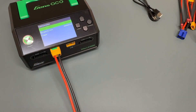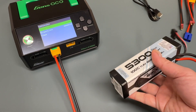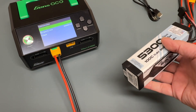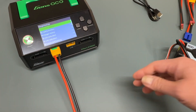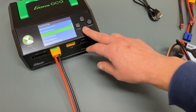For safety, it's not a bad idea to set the capacity limit to around the highest milliamp hour battery you might have. So if you've got a 5300, maybe set it to 5300. If you've got some 8,000 milliamp hour batteries, you can set it up to 8,000 — whatever you want. It's good to set that up just out of the box for safety. It doesn't really hurt to have that set. You can also view the charger history, which shows you the last thing it charged.